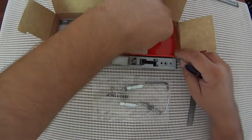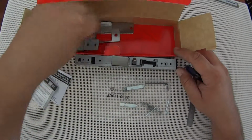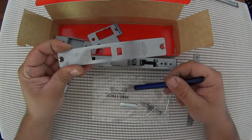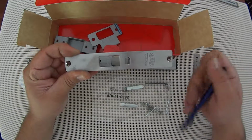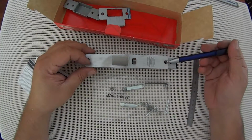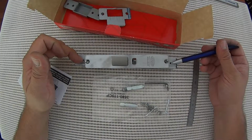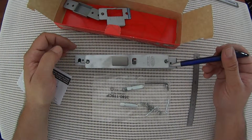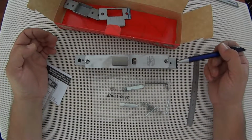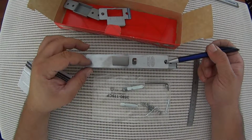two of which are to hold the faceplate on. I'll take out the instructions there. There's the faceplate. So you've got two screws. The little blue section on there which is Loctite to keep it all nice and tight. Simply put that over the top, tightening in your two screws. You also have another two screws which attach here. Now when this lock is installed, the aluminium will actually be covering this part in here and here as well. So of course you put the lock into the door first, here and here, tighten those two, and then you will tighten these two here as well.